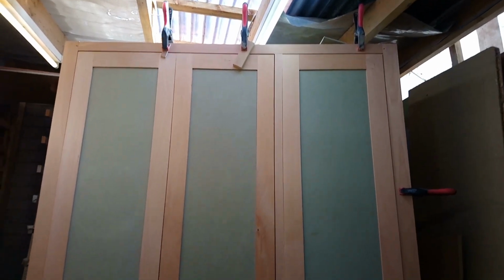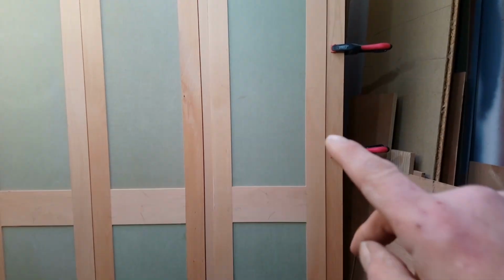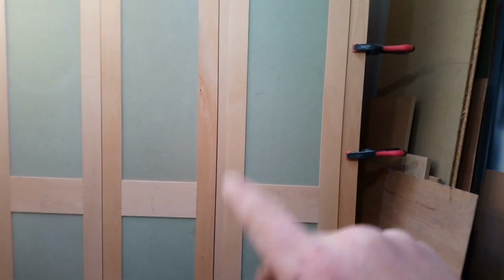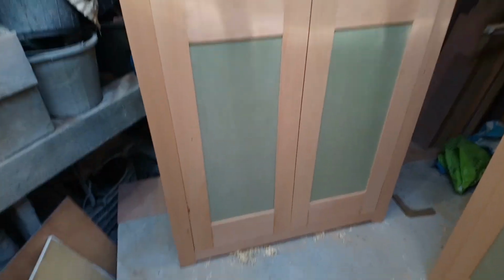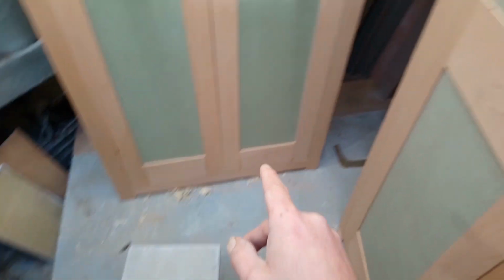It's a cupboard that's bent, which makes it awkward because that door's straight. I'm struggling a little bit with these, trying to get them to fit with nothing fixed back to. This needs fixing back to a wall and then I can hang this properly, but I can't do that. See, that's slightly bent. I've got a fairly parallel gap there, but it's touching top and bottom. Same there, that's not bad.